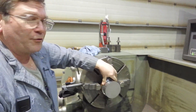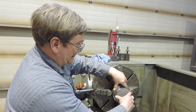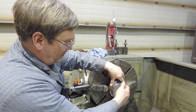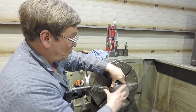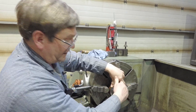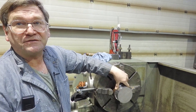If a part is out of round and you throw it in a three-jaw, it's going to run out of round. If you have a part that is a little bit oval, worn down a little everywhere, and you put it in a four-jaw, it will still want to run out. But if we have the same reading at four points, we have a better average of round than with just three points.